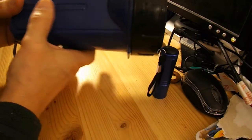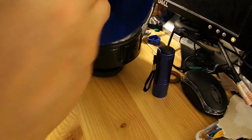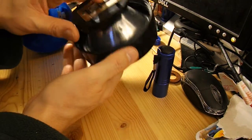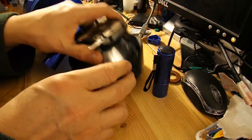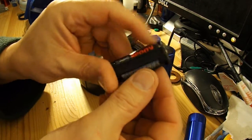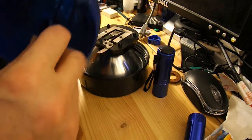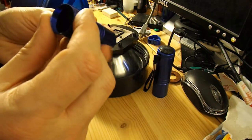This one should have one of those big square batteries in it, and that fills up that entire space in there. What I'm going to do is take this assembly apart, hot glue the 9 LED assembly in the middle of the reflector, wire it up so that I can still use the same batteries — it's a nice little battery pack that uses three triple-A batteries.